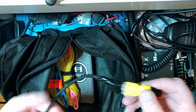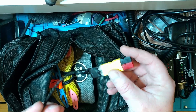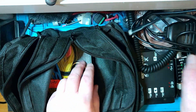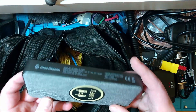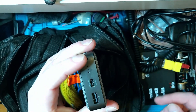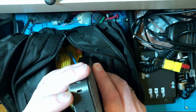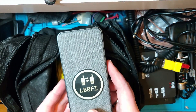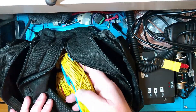I've got a USB-C power delivery cable, which is terminated into two power pole connectors. With that, I can use this power bank. This power bank has USB power delivery, so once you plug in the trigger cable, it tells the power bank to deliver 12 volts — and that's enough to keep the radio running for quite a while. This is a 20,000 milliamp-hour power bank, so I think that's going to last at least three or four activations.